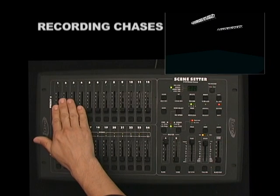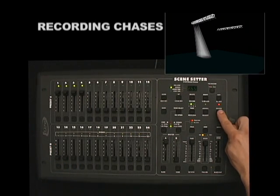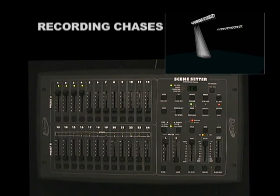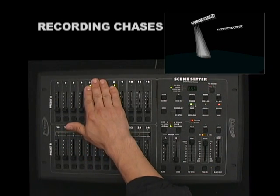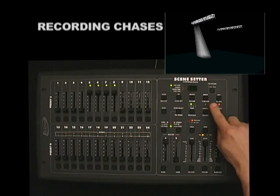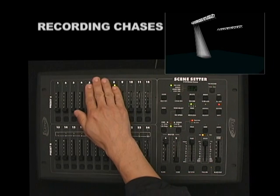Using the faders, set your first scene. Then press the record button to store it. The display window will advance by 1. Once again, using the faders, set your second scene, then press the record button to store it. The display reads 2, which advanced to the second step.